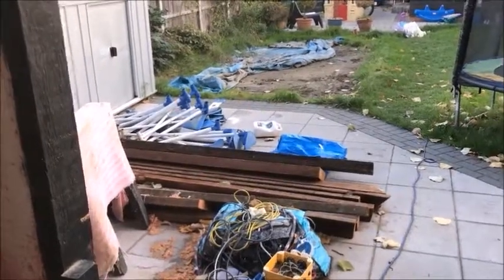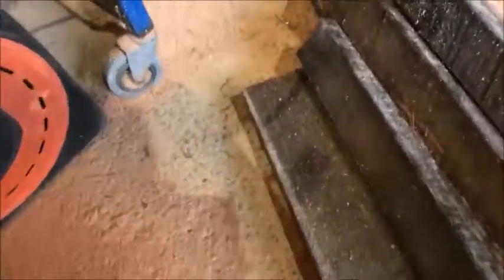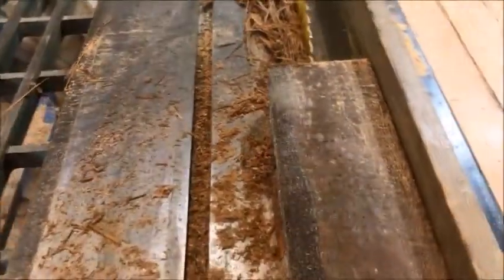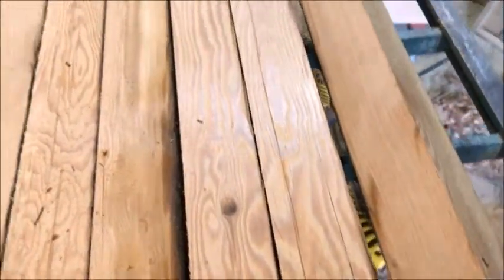Probably won't be finished anything because it's going to take ages to trim down all the wood. My workshop is still a mess. So here's what I'm doing: I'm taking the length of that, bringing it in here, chopping it down across the radial arm saw so we've got the lengths like that. I then take one of these and run it through the table saw, and I can clean up two sides in one hit — one side, two sides — and get them quite square.